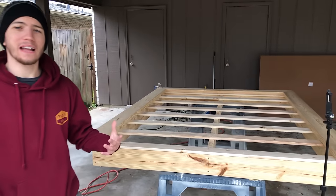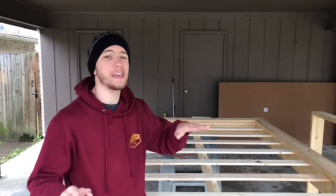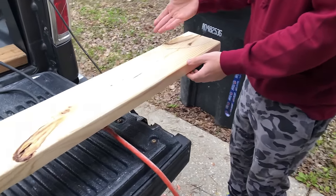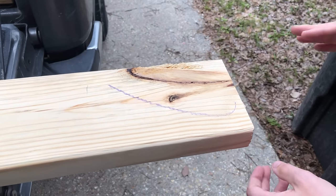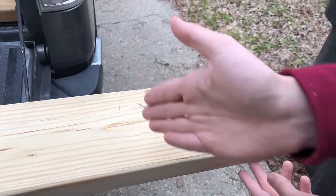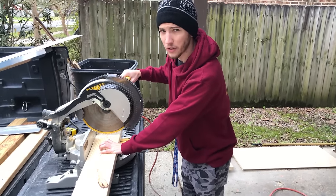It's the next day. We're about to cut the two-by-sixes for the braces that go underneath the slat to support the bed and keep it from wobbling. We've got this last two-by-six and we're going to chop off the garbage end and make our measurement from the clean edge. Our measurement is 30 and a half inches, so we're going to cut that twice.